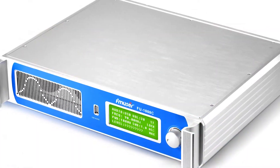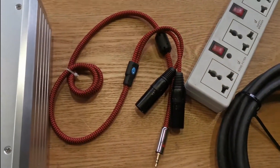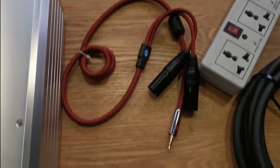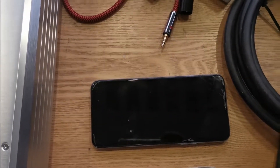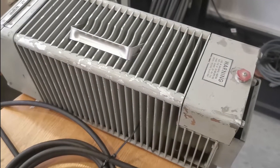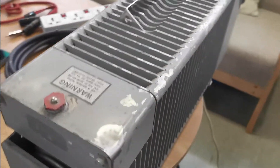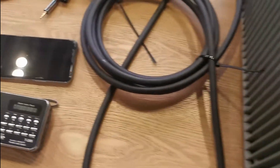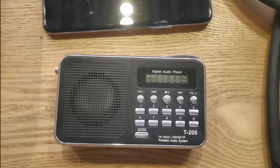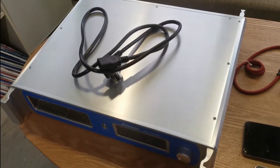Notice for radio transmitter buying: please always check before buying whether the standard voltage of the radio transmitter matches the local voltage in your area. The radio transmitter being tested in this video is 220 volts. The second item is the audio lines, used to transmit signals from smartphones or other audio sources. The third is a dummy load, used as an attenuator without radiating any radio waves. And the last one is a radio receiver, used to receive the radio signals to ensure your radio transmitter works well.